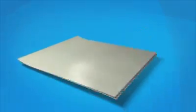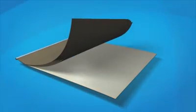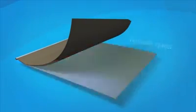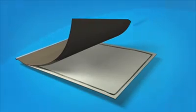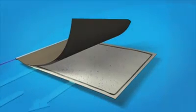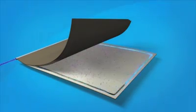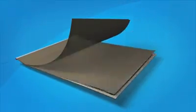A sheet of permeate spacer is added to the membrane sheets and feed channel spacer. This enables the final recycled water product, or permeate, to flow evenly across the entire membrane surface, even under high pressure. The back of the membrane is completely sealed to the edges of the permeate spacer. The membrane sheets are glued along each of the 3 exposed sides and rolled around the core tube.